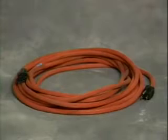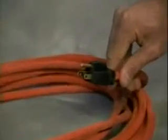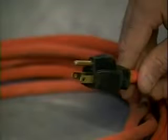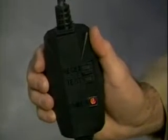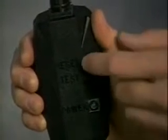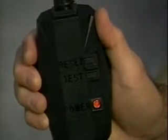If the Model 88's power cord is not long enough, use a 3-wire heavy-duty extension cord with a grounding prong. Using an ungrounded extension cord is very dangerous. Test the ground fault circuit interrupter before each use. Press the test button, then press the reset button. The light will indicate that it is operating properly. Do not operate the machine while standing in water.